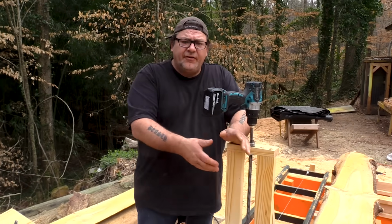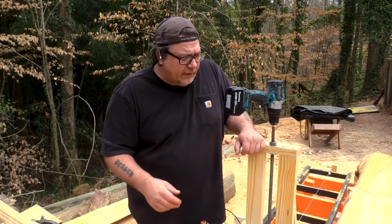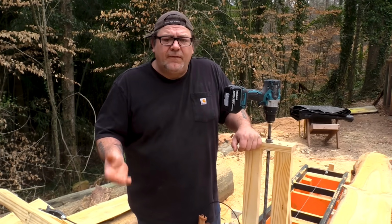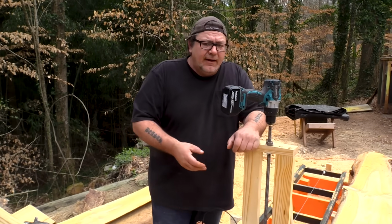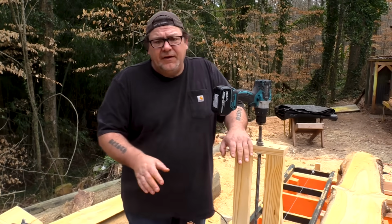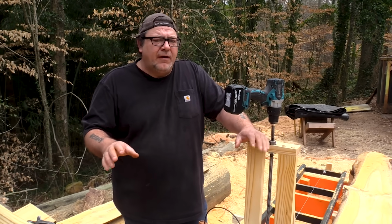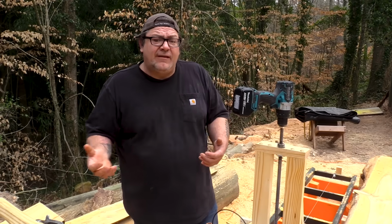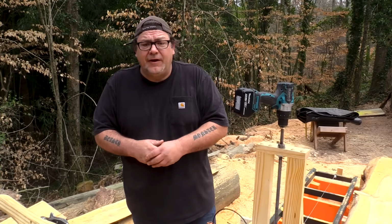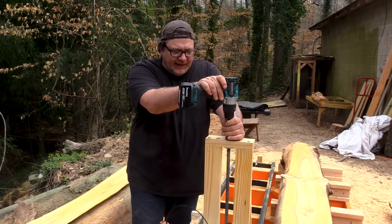But switching from a standard chain to what's called a ripping chain, and I'll put a link in the description box if you wanna learn more about those, can make a big difference in the performance of cutting through the long side of the grain rather than cross-cutting. Having that ripping chain on the saw makes all the difference in the world. But it's a true rule of thumb when you start talking about saws. The bigger the saw, the more cc's the saw, the bigger the log you're going to be able to cut comfortably.